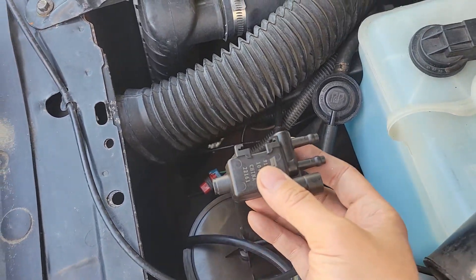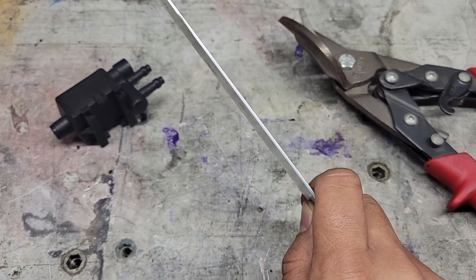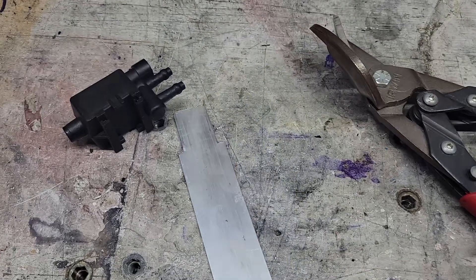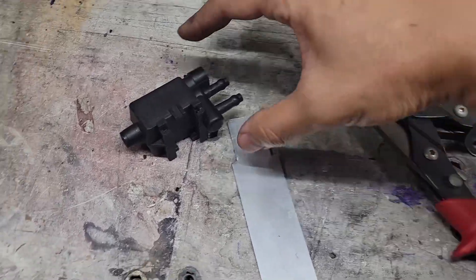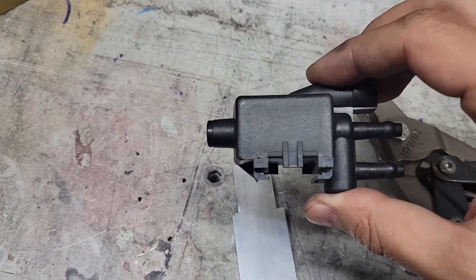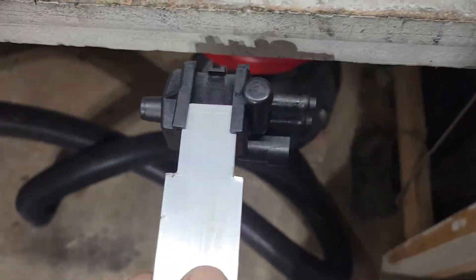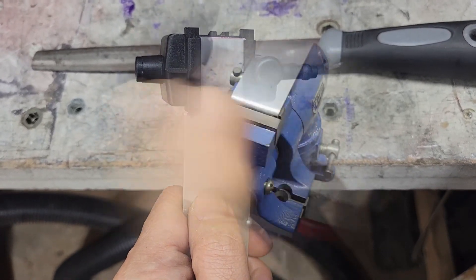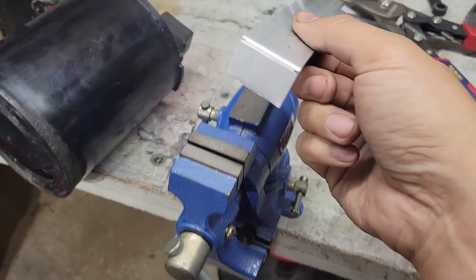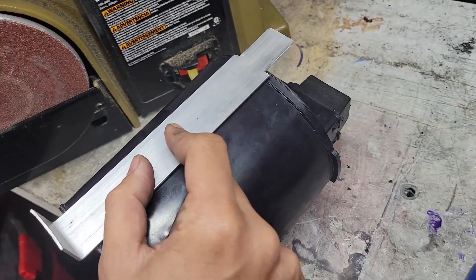Time to go inside and fabricate a mounting bracket. I had some leftover inch and a quarter wide, sixteenth inch thick aluminum flat bar. I cut the end to look like this using my offset snips — this is one of my favorite cutting tools. If you look at the bottom of the solenoid, you'll see it has two different spacings in the mounting point. The new bracket will fit the inner one, which is a little taller. Now to bend the other end 90 degrees. I want it so the bottom of the solenoid sits just above the canister. I left a three quarter inch tail on the end. The bracket is going to sit right about here.